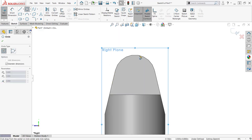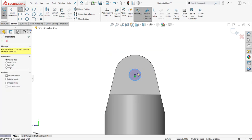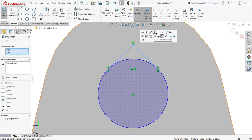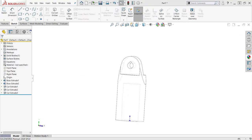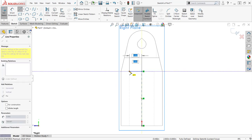All right, so this one, you can see here, I'm waking up the center of this arc by hovering my pencil over there. And that'll make sure that this hole is centered on that arc. If it moves around, it gets bigger or smaller, I know that it's always centered there. Otherwise, I'm going through and adding these angled faces to multiple spots. This is purely for 3D printing. It allows me to print some of these things without any support material, so that's always preferable. Same thing I'm doing right here, I'm just adding in that angled surface with a revolve.